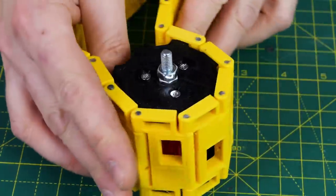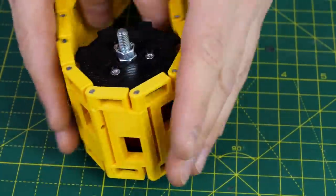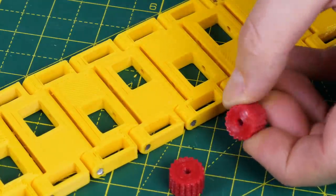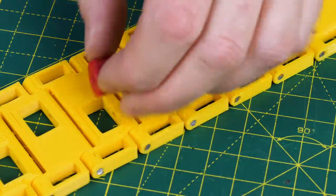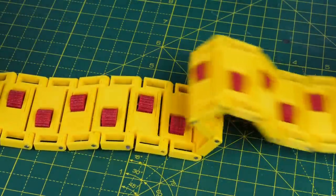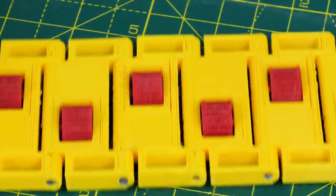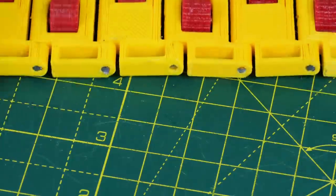I actually made several sprockets and sized these by trial and error, so I finally got one that runs really well after two or three attempts. That looks like everything's going to be fine to drive those sprockets and they should stay on the tracks. To make an omnidirectional vehicle we need to make them slide sideways as well. So I've printed some TPU wheels and there's one fitted in each track segment, offset from each other on each side of the track alternatively so that the track gets pretty well supported. The track still flexes and now it slides sideways with those little wheels rotating. Hopefully this will be sufficient clearance with the ground so that they can slide sideways and work just like omnidirectional wheels.